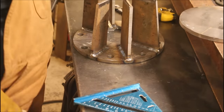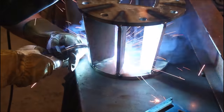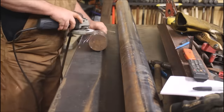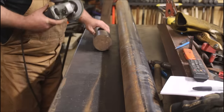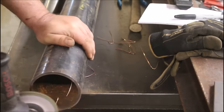There are eight plates because there are eight holes — six most likely would have been fine, but we went with eight. Welding the other plate in. There it is, all done and ready to go. Now we're prepping the pivot pin for welding — removing any rust, scale, or coating that might be on there, and doing the same on the end of the tube itself.